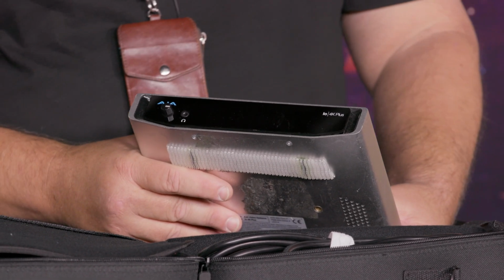Just the other day, I was using the 4K capability of this device, which means you can only have 1 device coming in, and I utilized a different device to get my video signal out. And with that, I was able to cut that video signal into 4 pieces because it was 4K, took 4 1080p signals out of there, and now I essentially was able to utilize 1 camera with 4 different looks.